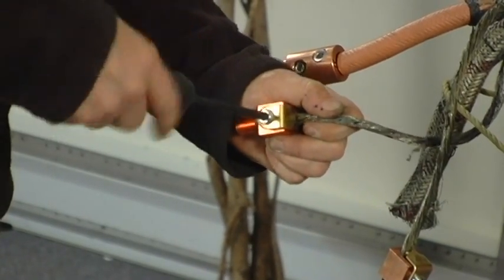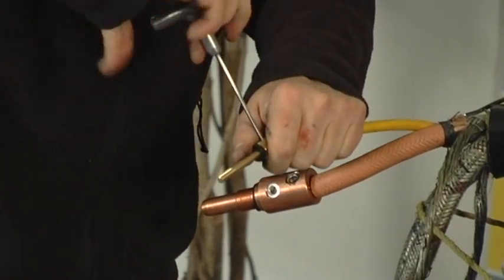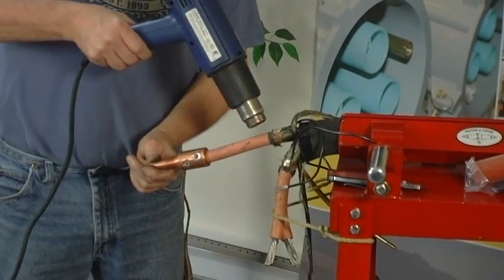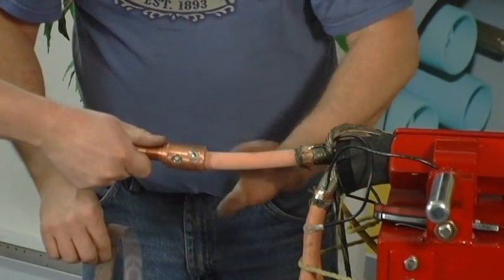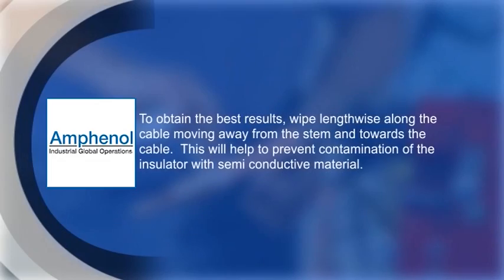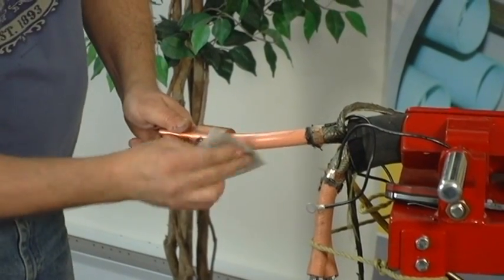This is particularly helpful for preventing cross-contamination once you start to clean the phase conductors. You can also rotate the cable to keep your active work area isolated. Clean the conductor insulation to ensure there are no ridges or indentations from the braided shield. With some cable types, a light heating works well for removing these small depressions and restoring the cable surface to a smooth finish. Final removal of ridges or blemishes will require a light sanding. A length of emery cloth tape is provided with each termination kit for this purpose. Use the supplied solvent wipe to remove any sanding residue or grit. The sanding and wiping processes may be repeated until the insulation feels smooth and clean to the touch. Running a finger along the length of the conductor will help identify any remaining ridges or blemishes.